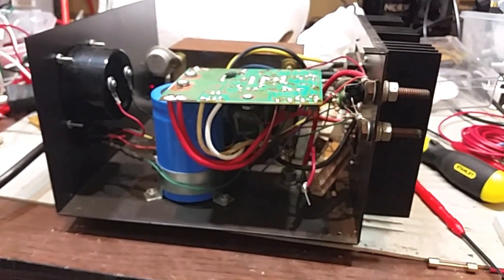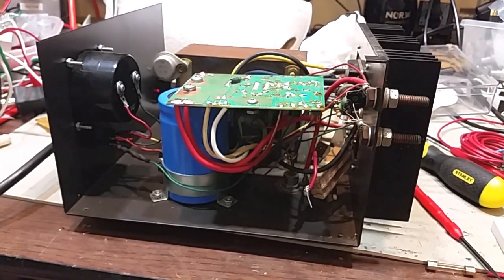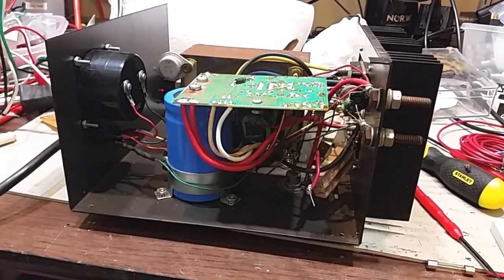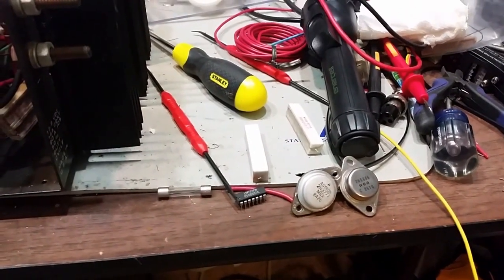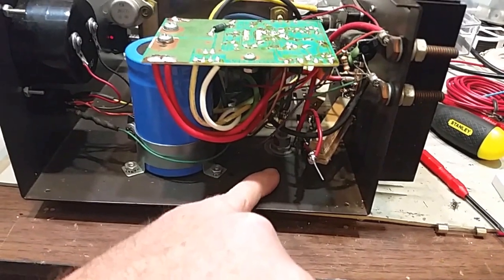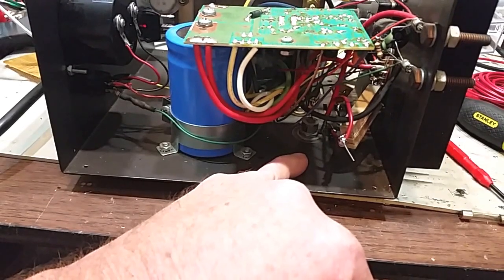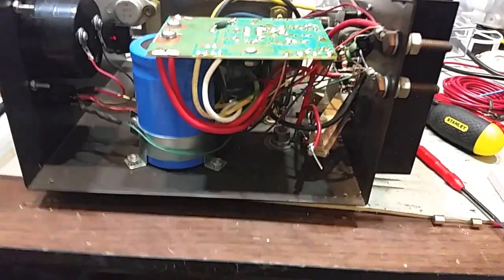That got me thinking more about Astrons. People talk a lot about what's the best supply. The crowbar is obviously a great feature — it protected the output, and anything connected wouldn't have seen an overvoltage. But it also burned up two transistors and a power resistor — probably it sat there and baked for a while. The one thing I don't like about Astron, and actually most hobbyist-grade supplies have a similar design, is that the crowbar has no fuse or anything for it to blow.